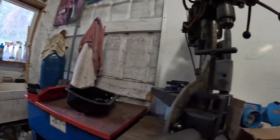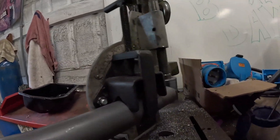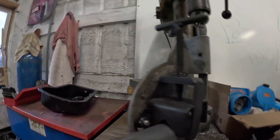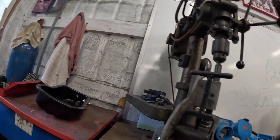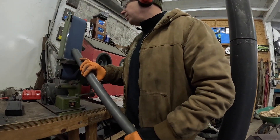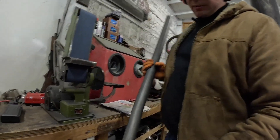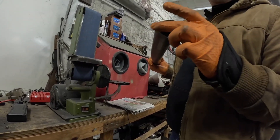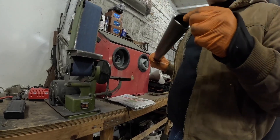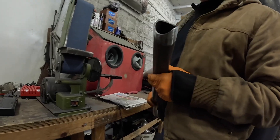How do you turn it on? It's just up on the left. You've got to be real gentle with it. If you look at this end, see how it's super sharp? If you weld on that, because it's so thin, it'll just blow away. So you want to turn it into a nice thick piece of metal you can weld on.